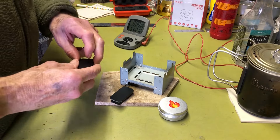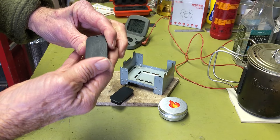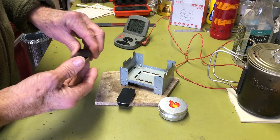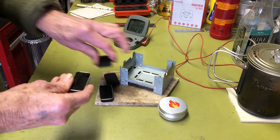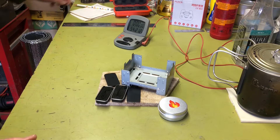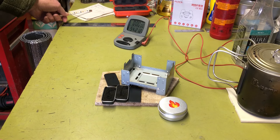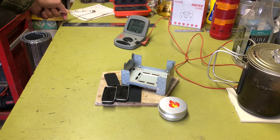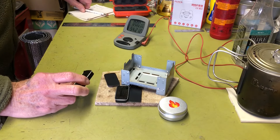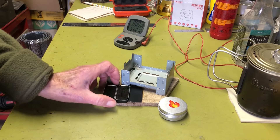Okay, let's get started. Yesterday I did a video showing the performance of this little half-ounce candy tin alcohol burner. I was thinking, and a commenter mentioned, about using two of these to see how that would work. I already did a test with the two of them and it was surprising — for eight ounces of water it came to a boil in three minutes and 53 seconds. That's really strong compared to yesterday's single burn, which only got to 193 degrees in about five minutes and 46 seconds.